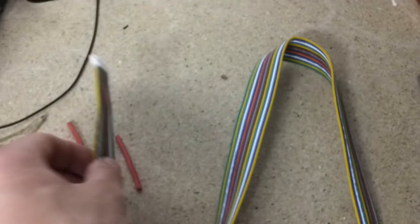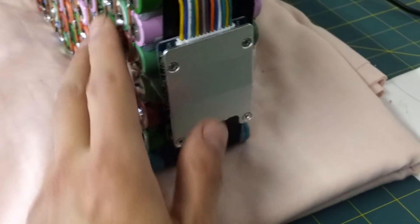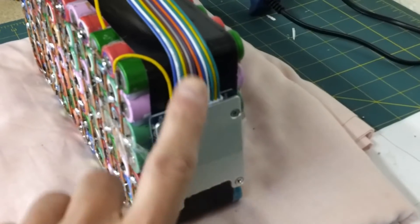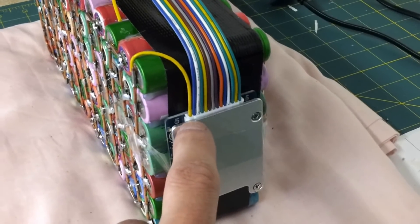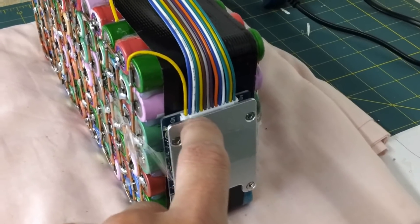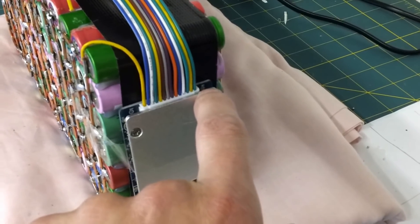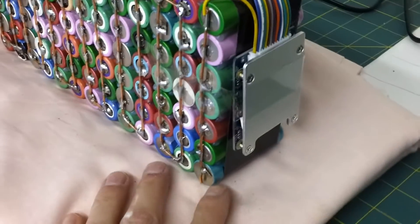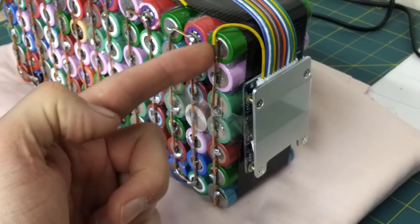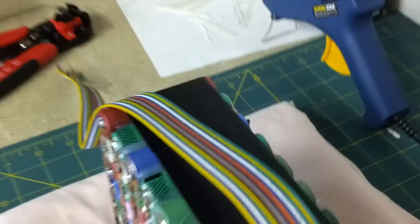It does come with a balance lead as well. Of course this is a 13S pack, so that fits. This is where I'm going to be placing my BMS — I've decided that's where it's going to be. I've held it in place with some sticky tape for the moment, and I'll be running a bead of hot glue across there to keep it in place. The voltages on this BMS go from zero to here, then plus each cell, each bank of cells across to here, up till 13S at 48V nominal, which is 54.6V charged to 4.2V per cell. This is the negative terminal for the whole bank, and the positive end is around the corner there.